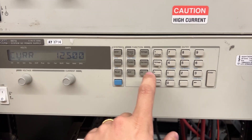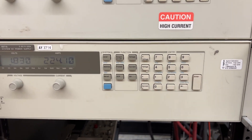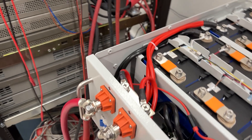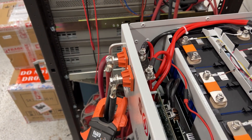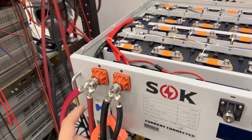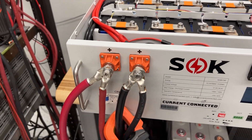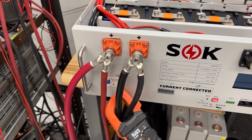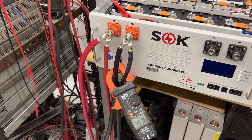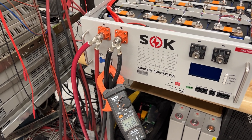If I come back on the power supply, I set the current to 225 amps — there's our 450 amps going through, as you can see. For a surge, I wouldn't be concerned about that at all. It definitely can handle the feed-through current. That's what's super nice about these terminals. A lot of other server rack batteries, they definitely go cheap on the terminals and they just can't handle this kind of feed-through current. Pretty awesome.